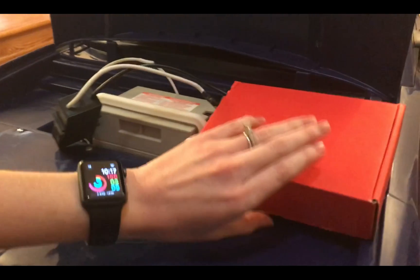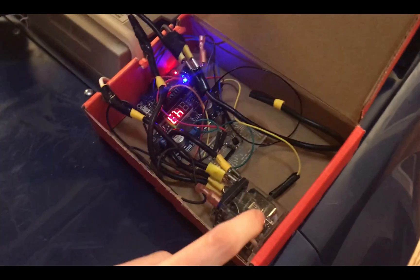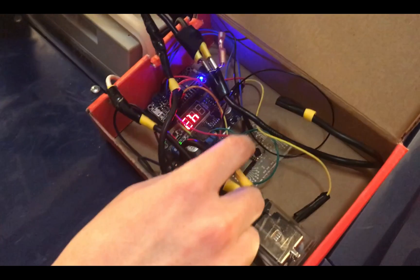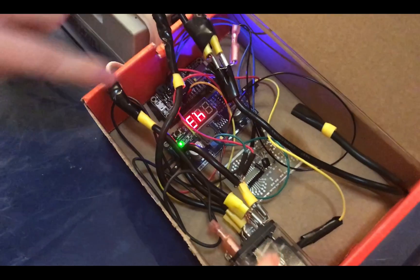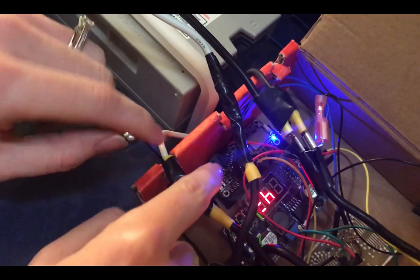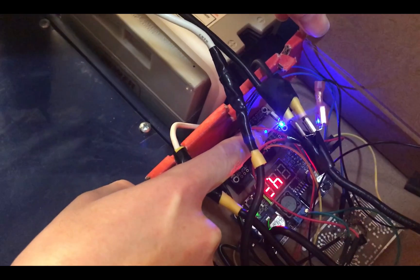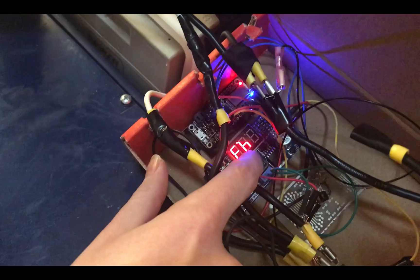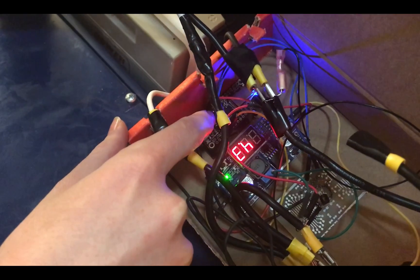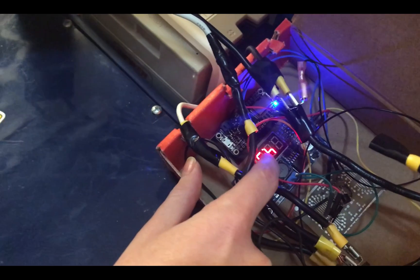For the final part, I can show you what's inside of the relay. Here I have a 12-volt relay and custom circuitry to hook up the relay to an Arduino board. This Arduino Feather board comes with a built-in Bluetooth module — you can see right now it's connected, the blue light is on. And this is a voltage regulator. The car needed 12 volts, but an Arduino board only needs 3 to 5 volts, so I use this to drop the voltage down to 4.3 volts. And that's my project.